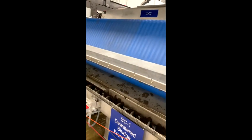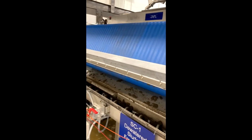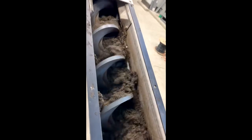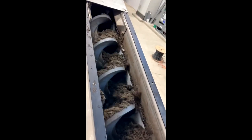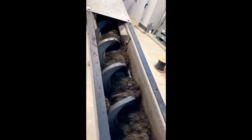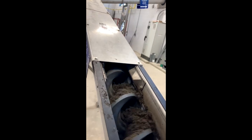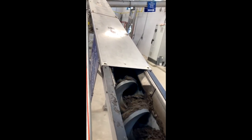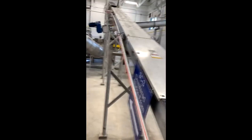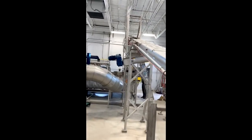You can see it comes off of there and it's pretty thick — it just looks like mud. We've been able to remove about 80% or so of the water from it. These screw augers will take that sludge after it comes off the belt press, and as you can see it's on an incline, it will work its way through this conveyor system up to the top.